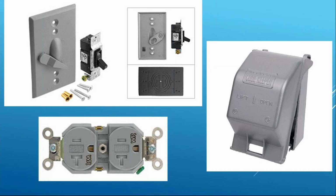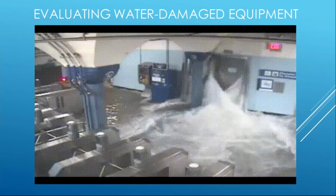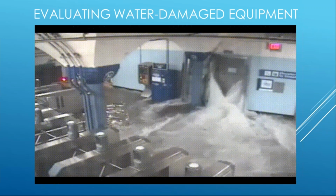If you put the whole system together, where your wiring method, your enclosures, and your equipment are all suitable for wet location, they are remarkably resilient to water and moisture. Then when you have an event like a Harvey or an Irma, you're likely to be able to re-energize much quicker than if these products weren't suitable for those conditions to start with. And then you get real extreme, right? We know things like oil and gas, marinas, and boatyards typically use these types of products, and they should be considered more often. If in doubt, go to these products that take it to another level of protection against infiltration of water. You can always go overboard rather than going under, that's for sure, when it comes to the code being a minimum standard. All right, I know I went through that really quick, but we think prevention is important.